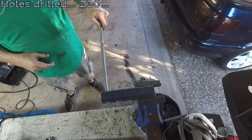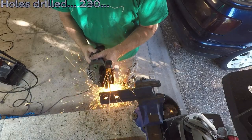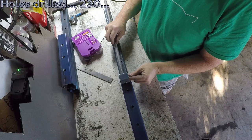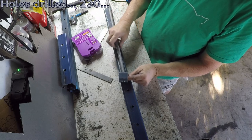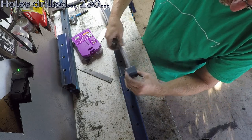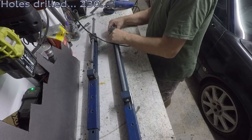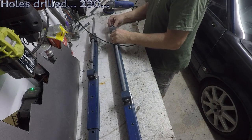The screw rods fit through and allow movement freely, which is what we want. We put one nut inside and a second nut just to stop the movement of the rod, then weld these to the bottom sections. Weld another nut to the top so it screws in and out, and then weld another one on the end so we can use a gun to wind it in and out.